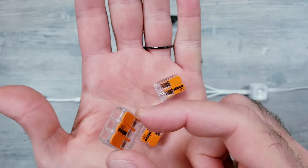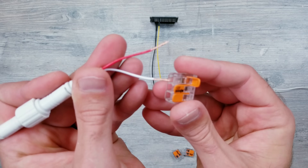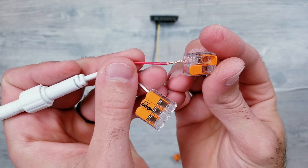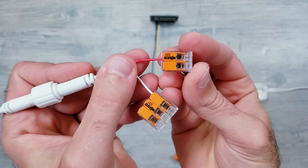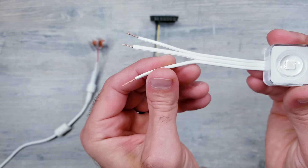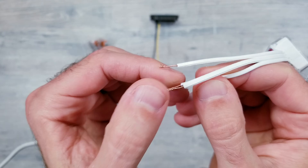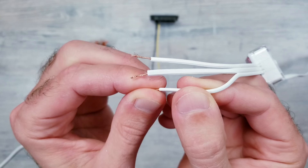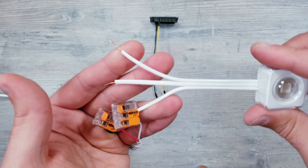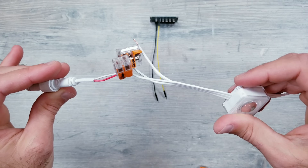I'll need one three-slot connector and two two-slot pieces. I'll first take the main power supply and insert the white negative wire into the three-piece WAGO clip, then do the same for the red voltage line, but this one will go into one of our two-slot pieces. Now, the biggest thing to remember is that when holding the lights flat, Govee has the top wire as positive, the middle as data, and the bottom as ground. I'm going to first take that bottom ground wire and insert it into one of the two remaining openings on our three-slot WAGO piece. Then I'll insert the top voltage line into the two-slot WAGO piece that has our other positive wire from the main power supply.